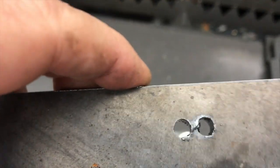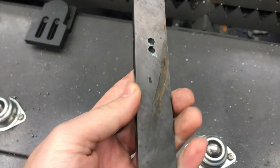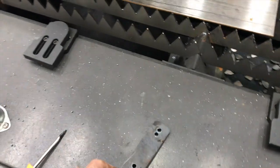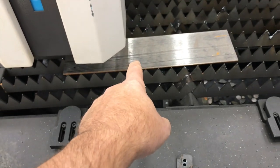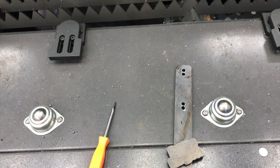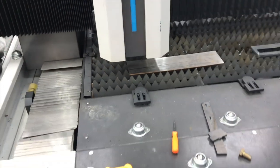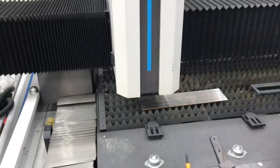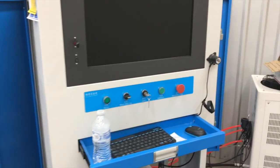If you tried to pierce in the center of a hole like that, obviously you're going to get some spreading out. Overall the edge quality is really nice, but it is a laser and it is what you expect. These two parts are going to go together, and I was cutting another part — some really small letters that go with this. This is going to be a branding iron, and it got the hole pierced right there and was starting to move to the next pierce point.